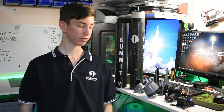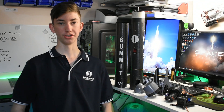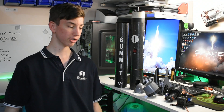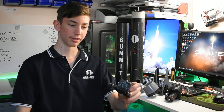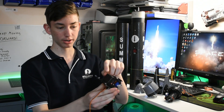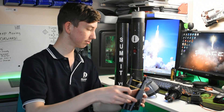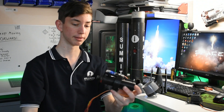The result was a 24-second slow burn with on-and-off burning and almost no thrust, causing the rocket to just stay on the launch pad and not go anywhere. The intense heat firing against all the launch pad and rocket components for 24 seconds caused major problems with the clamps — most of this is cosmetic and the clamps are mostly fine, but the casing around them is destroyed. This caused a fire to break out on the launch pad and on the lower rocket, which melted the landing legs, destroyed the thrust vector control gimbal, and the motor is now stuck inside — I cannot get it out.